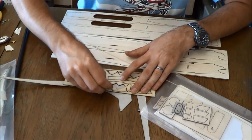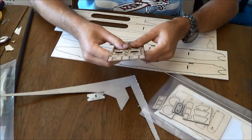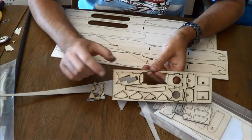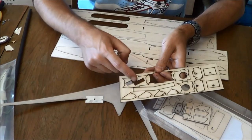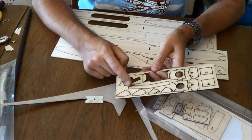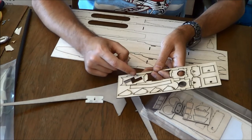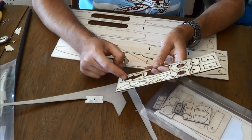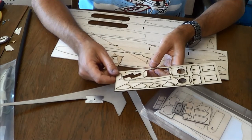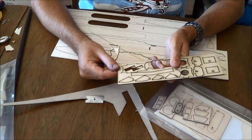Since I don't have KST X08s handy, this is what I'm going to use. Now, this servo tray here has narrower slots. This is sized for KST X08s. There's a Turnigy KS servo or whatever that is also the same size and will fit in here. I have tested those KS servos, and they actually work quite well. One of our Evo Fires out there has those in the wings, and it's working fine.